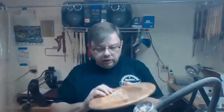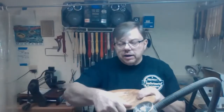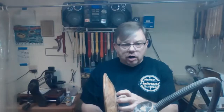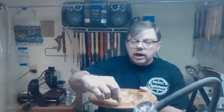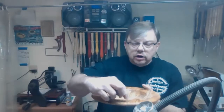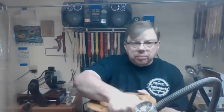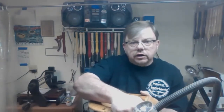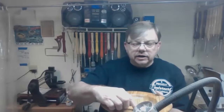And so if I needed to seal some part of it up, say here, I am going to take the whole chuck off the lathe and I'm going to turn it and hold it so that when I apply the glue, it's only going into the area that I need it to go into. I'm going to hit it with the accelerator. You could typically then grab it right away and I'm done with it. And that way I'm not going to get the drip marks. If I was to put the glue on here, I'm going to get those drip marks until it self levels.